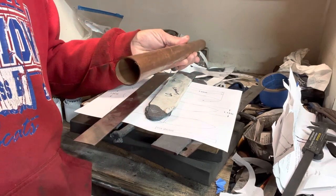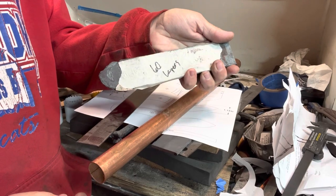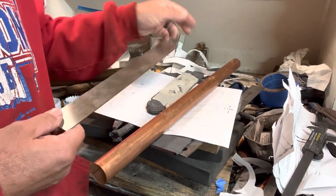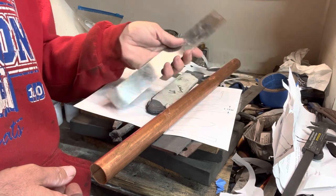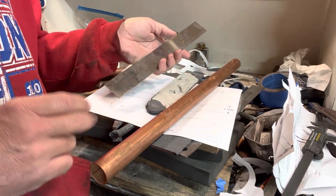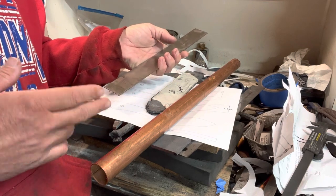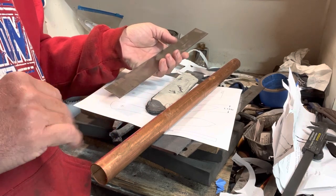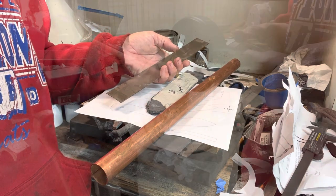The plan is going to be using some copper, 60-layer Damascus that I'd already made up, and we'll add in a couple of layers of 15N20. We'll do a cumi — I'll do four layers of the copper. I'll show you a little bit of the prep, but not a whole lot. Once I get it all stacked, that's where the video will really kick off.